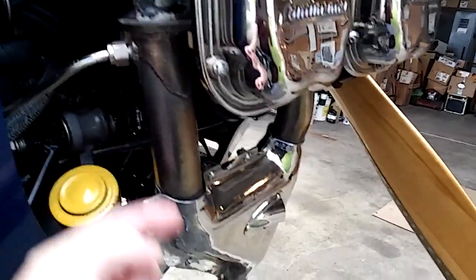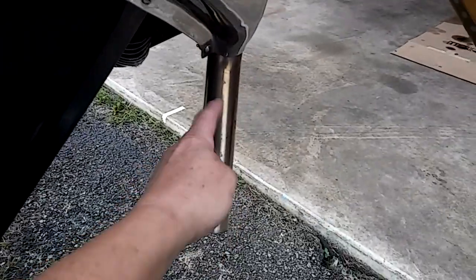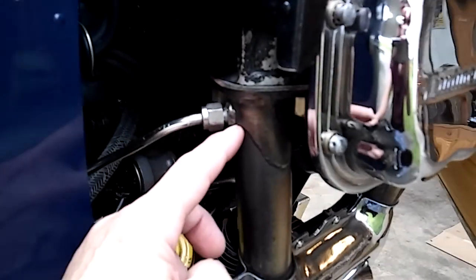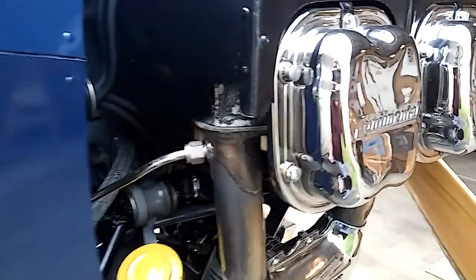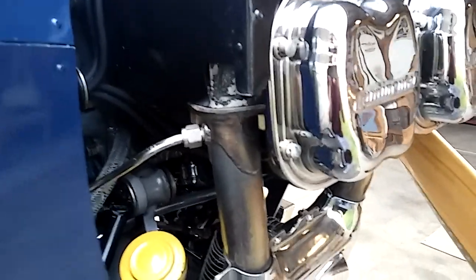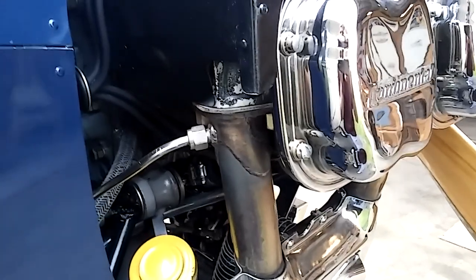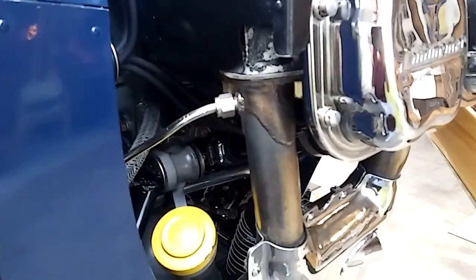You could drill the fitting in over here, or over here, or down here, but by the time the exhaust gases get down there, they're cooler — you want to get them when they're hot. I'm not an authority; I'm just an amateur home builder. But I have flown with the smoke system for 21 years, actually more than that. I had one on the Aeronca Champ too, so I've got this thing kind of figured out.